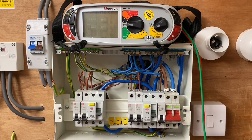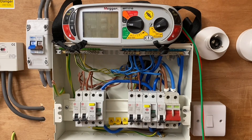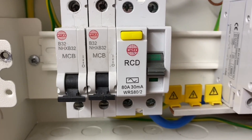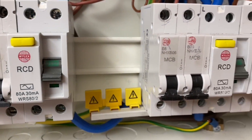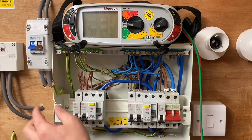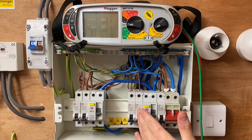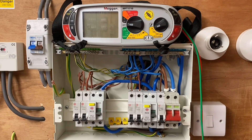Is the installation live because you've just removed the earth? No, it's actually still in the off position, and I'll switch on my external double pole switch just before I carry out the test. The circuit breakers and RCCBs are also in the off position. Why? Because we have removed our earthing conductor - if I had these circuits livened up and there was a fault to earth, we wouldn't have that earth fault loop path and we wouldn't have ADS in place. Good thinking - so for safety reasons, we're completely off.